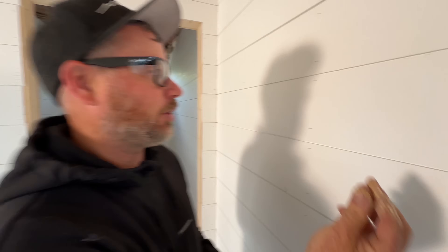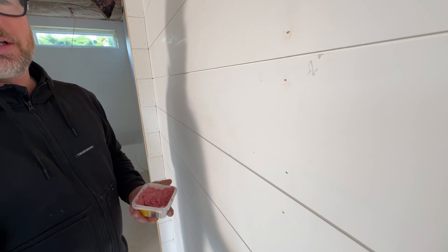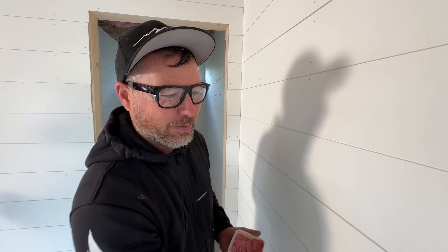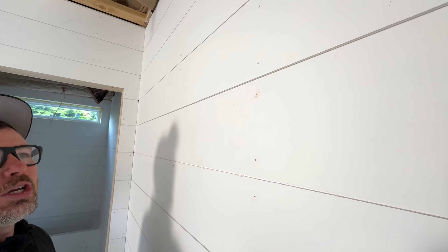While these guys are just smearing the filler in with their hands, what I like to do is get a ball of this stuff made up that's a little drier, then just press it into one of the holes and sort of twist it off. It leaves it a lot cleaner and you can go pretty fast. After a minute it gets too dry and crumbly, so I knead in a little of the wet filler to get a better consistency. The totally wet filler is too smeary — I want like a cookie dough consistency. I've filled a lot of holes with dad back in the day and this is just what I figured out. It's the little things that save time when you've got to fill like 10,000 nail holes. My best guess is we used two boxes of nails — 2,000 each — so about 4,000 nails total.